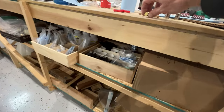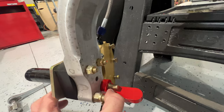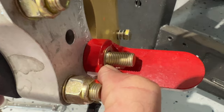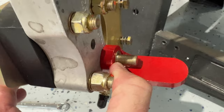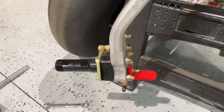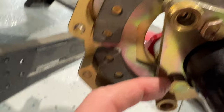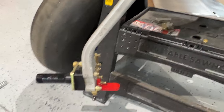There's a washer — sure enough, there is a washer. So let's get that washer. I wasn't going to film today so I didn't bring any tripods, but you can still see it's showing a little bit of the shank — the unthreaded portion of the bolt. I'm not going to fret and get a different size bolt. All I'm going to do is put a washer over there to back the bolt out just a hair, and that should take care of it.